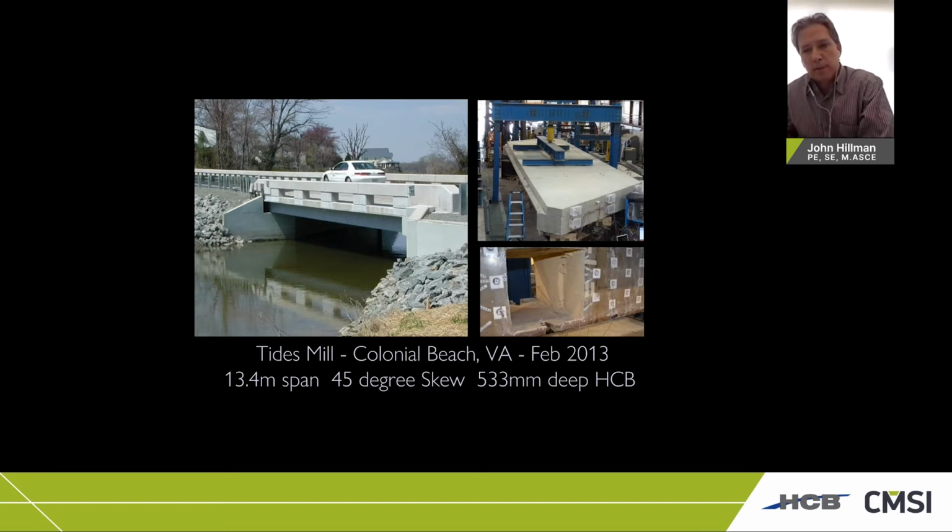So now to put that in perspective, here we've got a 2-lane bridge with 8 beams. So for all intents and purposes, you've got 1 truckload or 1 lane load on 4 beams. So each beam needs to be able to take at least 25%, really more with the distribution factors. We took 1 beam out, cut more than half the strands out, and we could support an entire HL93 truck on 1 beam. And that gets back to what I said. I mean, generally, the limiting design criteria on this is live load deflections. And so once we satisfy deflections, we generally have way more capacity than we need for the design limit strengths.